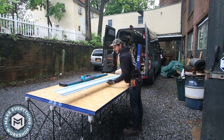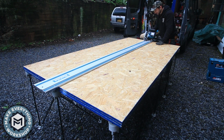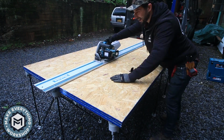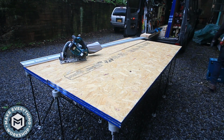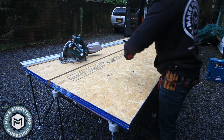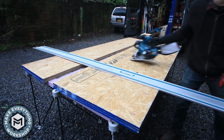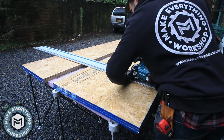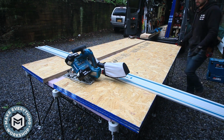I did a lot of planning before this project, so I know that I have the room in the design to be able to screw these pieces together and gang rip them all at once. You don't always have that capability, but in this case, since they're getting covered in grass and there's a couple other factors, I'm able to rip them in this coarse way. And they actually were all very true to their dimensions, so this worked out really well.